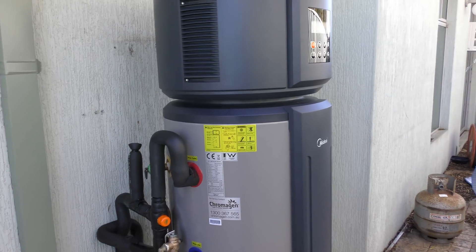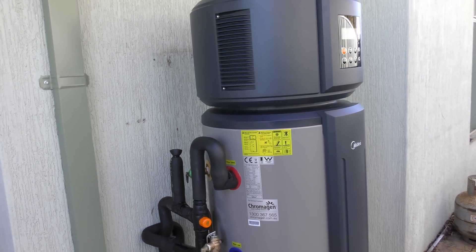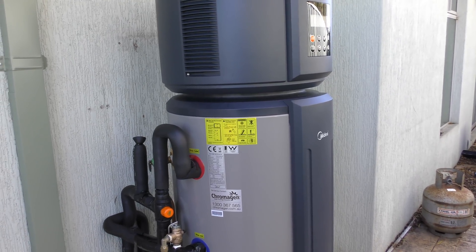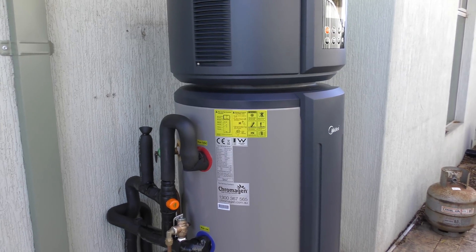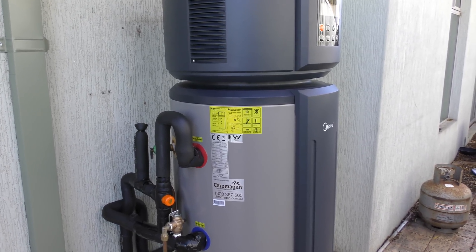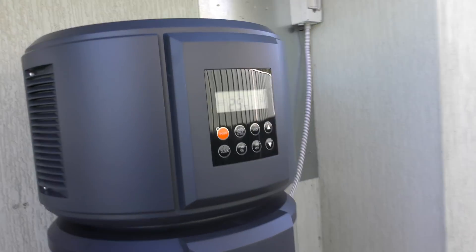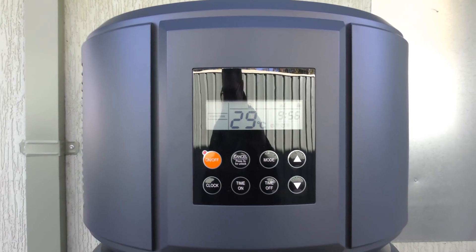The Sun Flux — I do recommend it. It will be really good if you're on the grid, because with a few panels on your roof, most of the time you'll be running off solar. However, if you need to boost during winter you can just boost off the grid. Whereas with an off-grid solar system, if I'm not getting enough power to make hot water I'm probably barely getting enough power around the house to charge my batteries, and you can't really afford to put an extra 3,000 watts into a hot water system. This unit in hybrid mode is already up to 29°C.